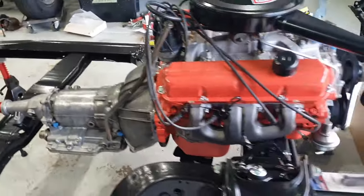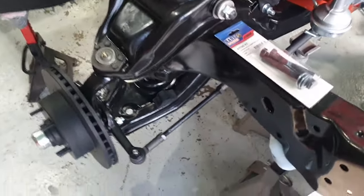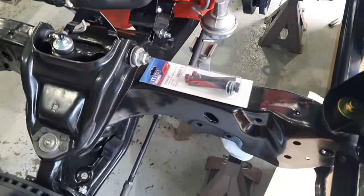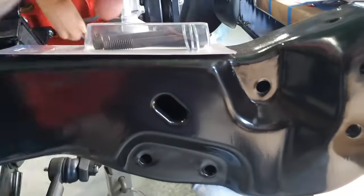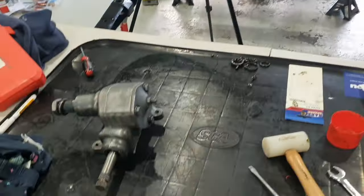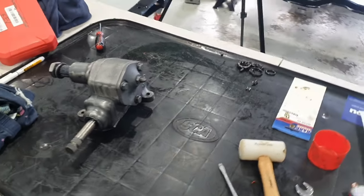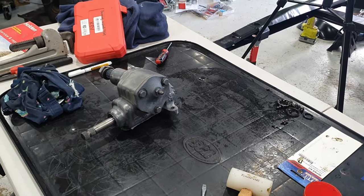I've got the transmission in like I showed in the last video, the steering box bolts are ready to bolt in, and the steering is all connected up. I've just got to put the split pins in the end of these tie rod ends. The steering box just bolts in with these three bolts through these holes and into the back of the box - the box has threads on it. Keep watching and we'll get that underway as well. I might include the installation of the steering box with this video. Thanks for watching - don't forget to hit the like and subscribe button. All the subscriptions and likes help show YouTube that people are enjoying it. Hope you did enjoy it, see you next time.